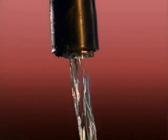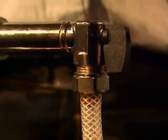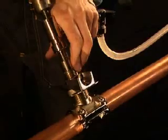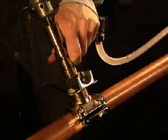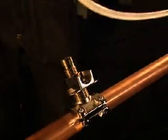Chips may be stuck in the non-return valve if liquid continues to seep from the hose, also after the drill housing has been withdrawn halfway. Close the cock on the flushing unit to prevent damage to the non-return valve when the drill housing is pushed back through the valve. Open the cock again, then pull out the drill housing halfway and check that there is no leakage from the hose.